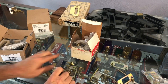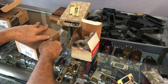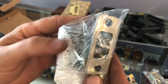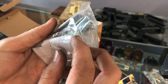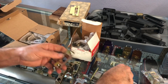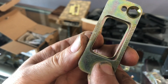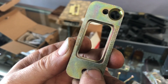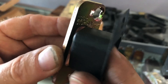If your lock isn't catching right, you simply have to move the latch strike back and forth, which probably means you need to mortise it. The 10-116 strike still does come with some Schlage deadbolts, minus the dust cup. It comes with round corner strike plates, security strike screws, however the screws have a slightly different head shape to sink down. Holding a new one up to an old one, you can see a significant size difference.